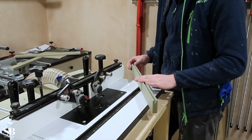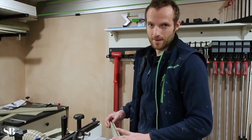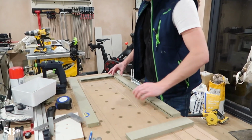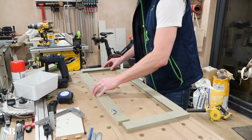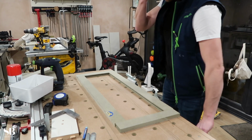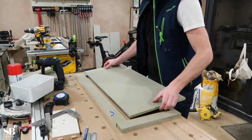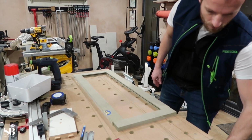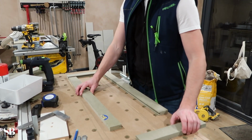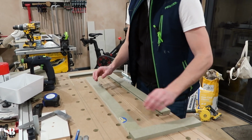So I've now got to do that about another 50 times for each piece before we go on to thinking about assembling it. So this is the rough shape that it will be. They're quite wide and relatively shallow, so it'll be about that. And then there's a panel that gets inset into it. So this panel, hence why there's a groove in it, slots into that. So what I've done so far is I've run the main groove into them, but the next step is to make a tenon out of this bit so that it locks into here, which I've got a test piece.